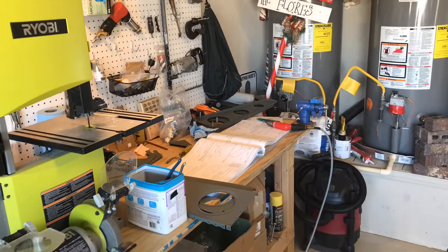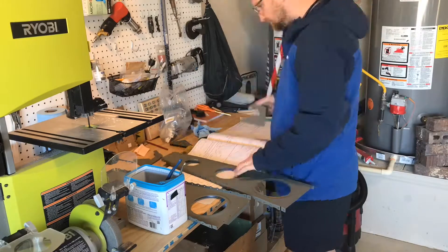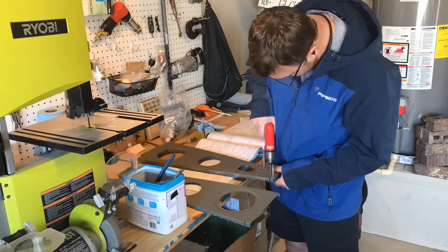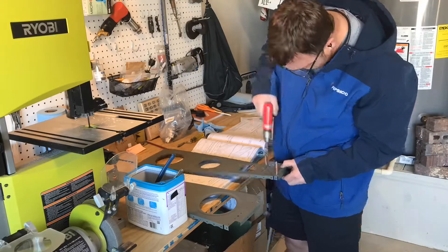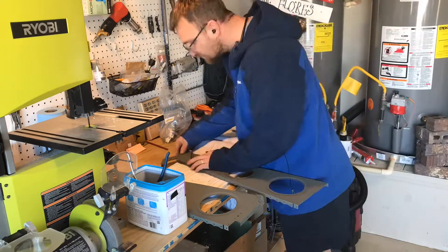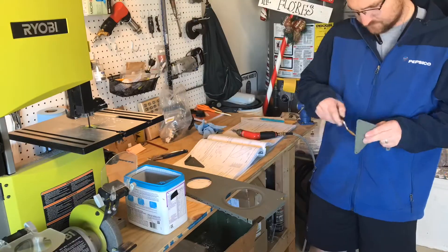Once you do all that you have to deburr everything, take everything apart, deburr it. You're not actually supposed to reassemble it at this stage, but I went ahead and put everything back together because when we move into the wings, you can't have the hinge assembly attached to the ribs when you attach the ribs to the wings. I put it back together so I know which ribs I drilled and which ones to match to — I'll be able to identify what goes where when we do have to reassemble these later on in the plans.